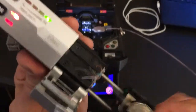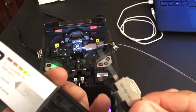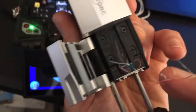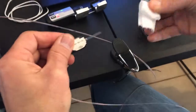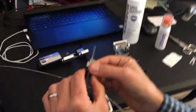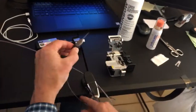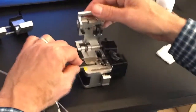We got a good clean strip — it took all the coating off the fibers, but you can see in our thermal stripper how it gumped that up a little bit. That's just what you're going to get when working with rollable fiber. The three steps are: strip it, clean it, cleave it. Use your normal cleaning fluids, make sure no fibers are laying over top of each other, then put it on the cleaver. From this point forward there's not a lot of difference — the main difference is really that thermal stripper.